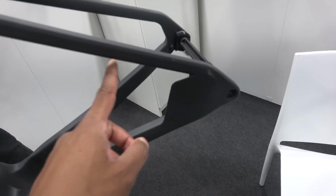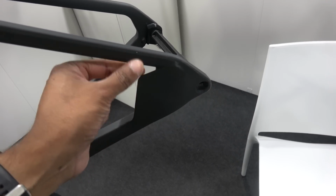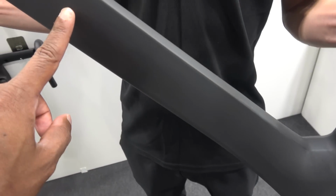So, I'm over here at Light Carbon. And, you know, they actually yelled, "Hello, Hambini fans." But anyway, what took my eye was this. So this is something I haven't seen before. It is a 3D printed frame that's carbon. So all of this is 3D printed. So to give it the strength, they've actually had to put fins in there to make the second moment of area sufficient to take it. And then we go all the way here, and you can just about see the little dots that come in. And then the scratches in here, and I guess this has been sanded slightly afterwards, but that is fairly incredible.